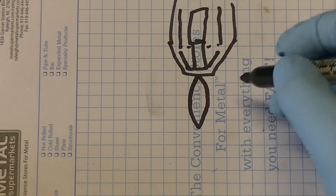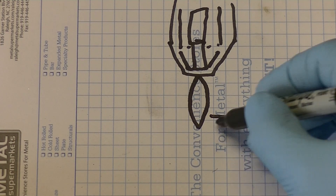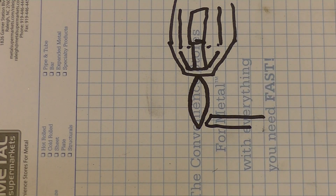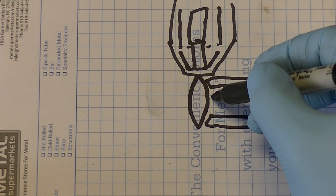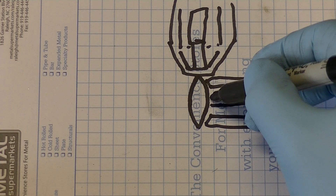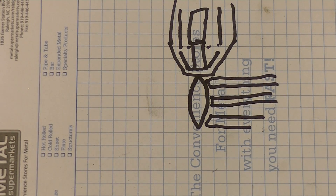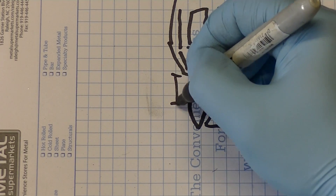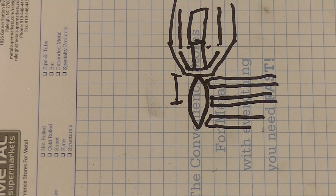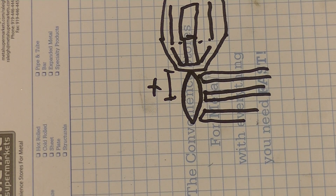When we're looking at cutting metal, depending on how high the torch is from the material, you can see that angle. If you were really close it would cut at different places. The sweet spot is right in the middle where it's pretty flat. There are lots of things that can cause beveling, but the height from the torch to the material is pretty critical. This optimum height is what we're shooting for whether you're working by hand or using a CNC machine.